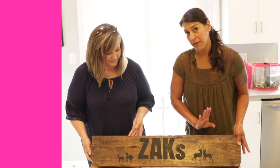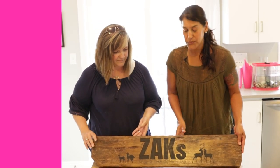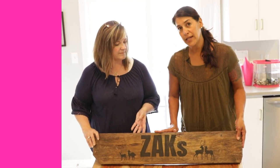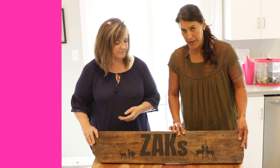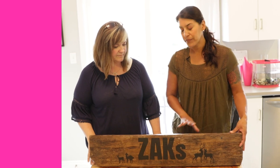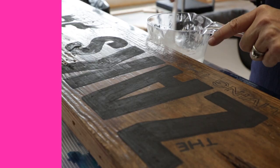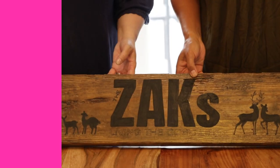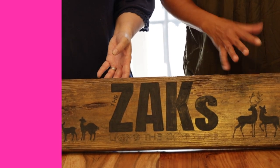There are a couple of really important things to know, especially if you're going to resin wood and keep it outside. First, you want to make sure you resin the entire piece so it's totally sealed — that makes it weather resistant. If you leave a patch or leave the back un-resined, moisture can get in, and with temperature fluctuations you'll get expansion and contraction, and your resin might end up cracking as the wood changes.